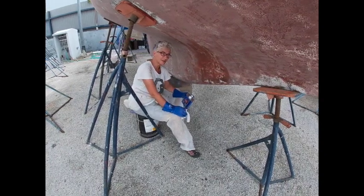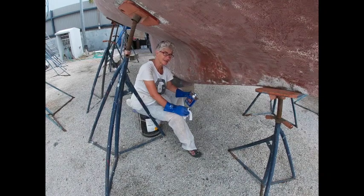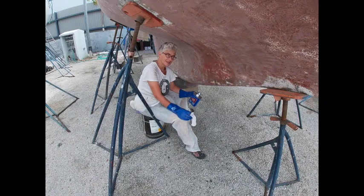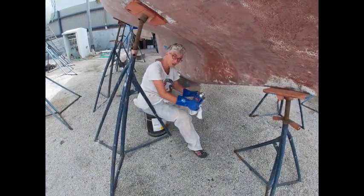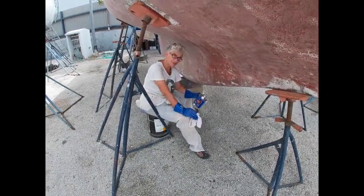but my friend Ian here is. Why am I nervous about it? It's two-part paint stuff, and it's a little scary, and in this heat, it kicks off pretty fast. But you've done the research, haven't you? Yes. I talked to the company, and they said it should be fine. One coat in the morning, one coat in the afternoon, tomorrow one coat in the morning, and then anti-fouling.